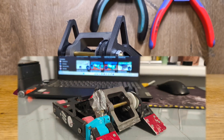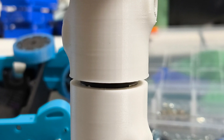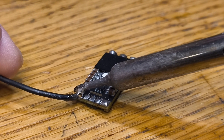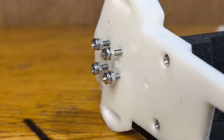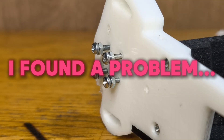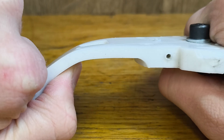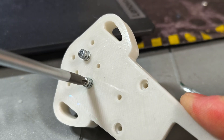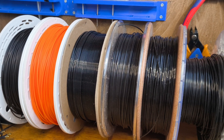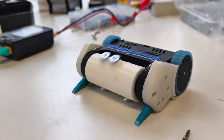Hotline won't compete in this competition for obvious reasons, and its 2006 2750KV brushless motor is a perfect fit. I quickly soldered in a 35 amp ESC, and all I needed was to screw in the four screws that tighten the motor. But the motor can't be attached tightly as that side is soft, so the screws just squeeze the motor. Which filament is harder yet still impact resistant? Nylon survived well for the Drombotics kit's weapon, so that was my choice.